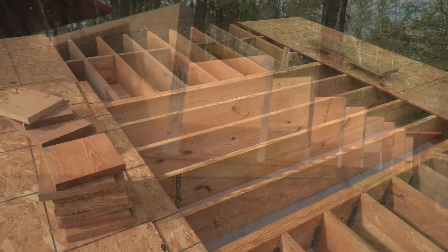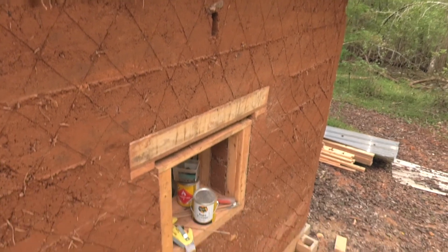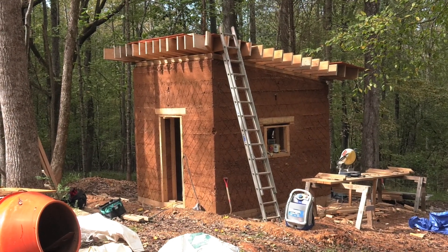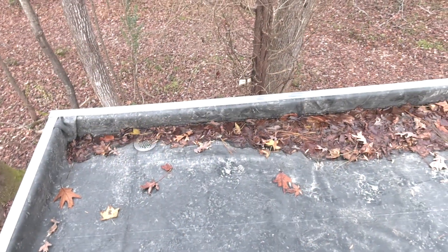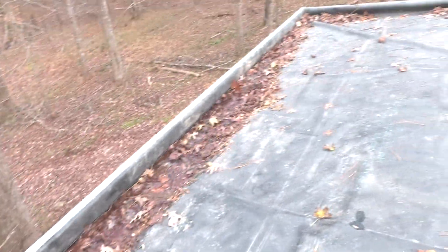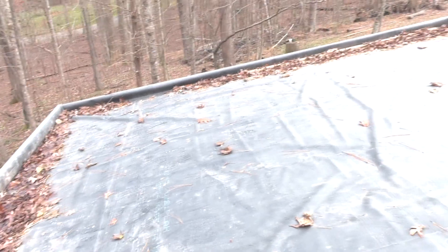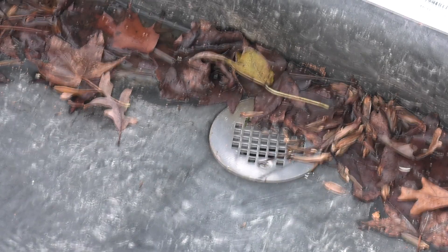Here's a pretty good shot of the finished roof. The cob is drying out at the top — you can see the bond beam and the box beam over the windows and the door, which is about to get covered up. We're trimming it all out and getting a green roof on here that's about four or five inches deep: about two inches of gravel and two or three inches of soil, which will get a little growth of green but it's mostly to protect the roof and have an interior gutter that doesn't ever have to be cleaned out.